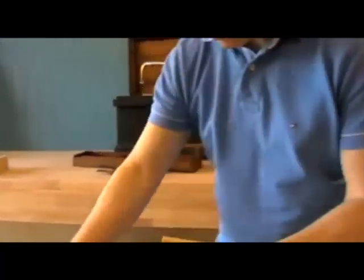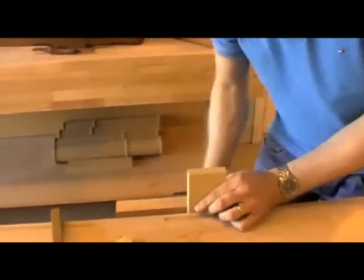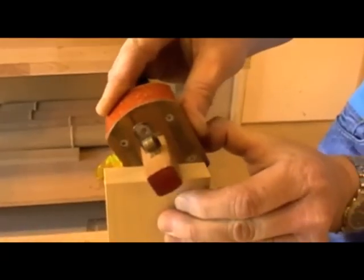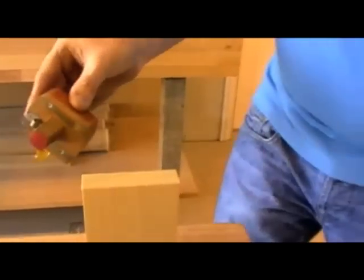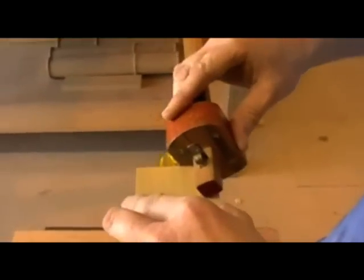Here we go — see how quickly we can go about this. I've got my cutting gauge set up to about two thirds of the thickness of the drawer front. I'm going to scribe a line across my end grain. I'll just re-strike that so it's nice and strong. I'm going to use that same mark on the end of my drawer side.